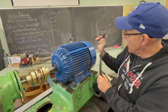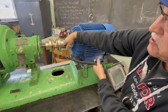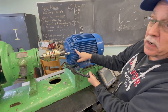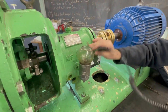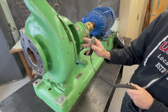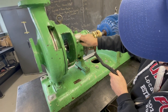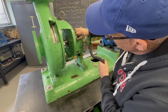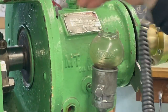Take your horizontal or vertical reading on top, and then an axial reading. A lot of times the axial reading from position one and position two will be the same, so we'll just take an axial reading at the two position: 1H, 1V here, then 2H, 2V, 2A. Then over to the pump: three horizontal, vertical, axial, and position four — not out where the impeller is, but where the bearings are. Two bearings in this pump, inboard and outboard. Rock the accelerometer, get it solid, one-two-three-four-five, take the reading.